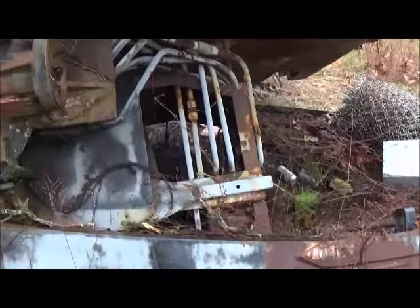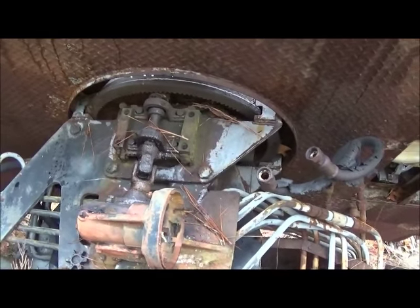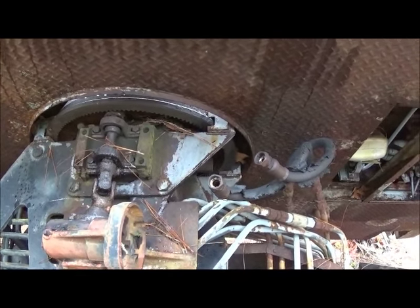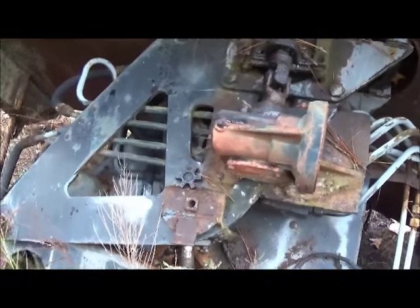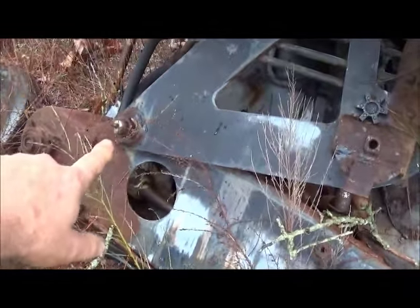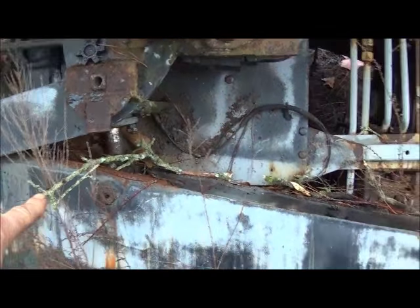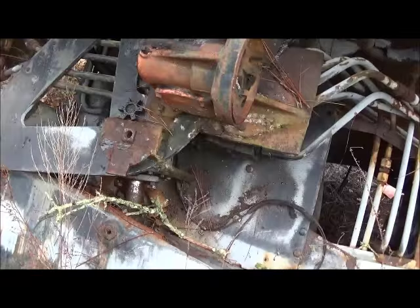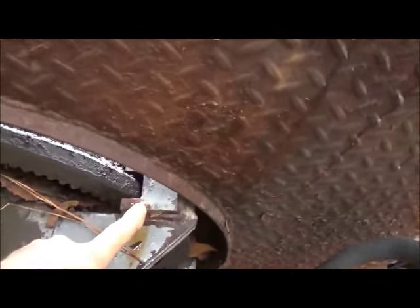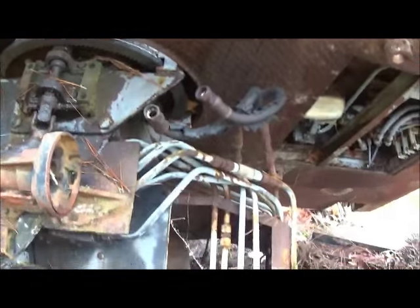The boom was a little bit warped on this unit, and they had put an extension on it about 10 foot. Instead of sticking out the back of the truck, they would swing this thing around and stick it out the front of the truck with a piece on the bumper, and they used it for pulling well pipe, and they sort of hurt it. But you can see what I was talking about: right here's our pivot point, right here's our cylinder. Everything from here forward all the way on this boom is all overhang, and I don't know why they built it that way. I don't like it. I do like the safeties. They've got safeties around the slewing gear in case something was to happen, it couldn't come loose.